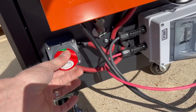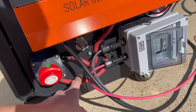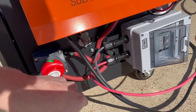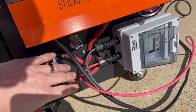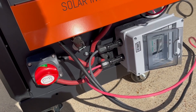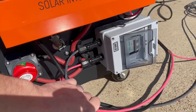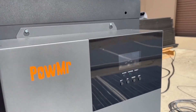We do have a battery disconnect switch here just for convenience — don't necessarily need it. The BMS on the batteries is set to 100 amps; if I ever added a second set of batteries I'd really want to fuse between the inverter and the switch, and between the switch and the batteries, just to keep things safe. There's also two-gauge wiring here which can handle a pretty heavy load. The special thing I was talking about is really this solar wiring — it's only 12 gauge because we're running high voltage, all these panels in series, so I'm up in the 300-volt range for this off-grid inverter.